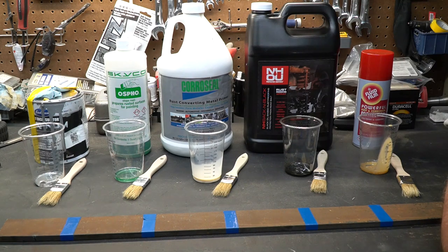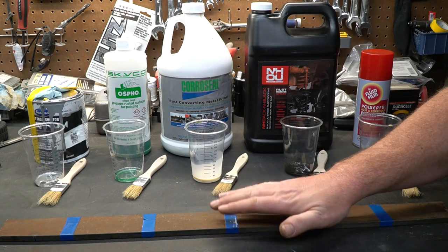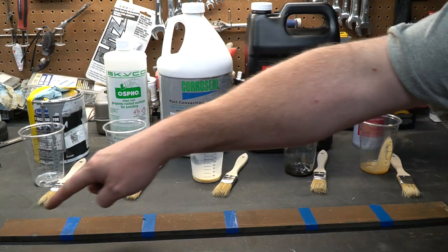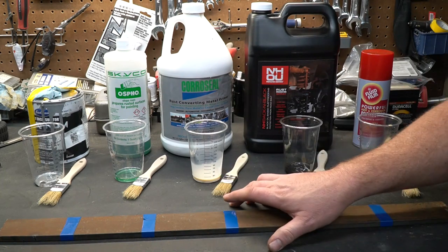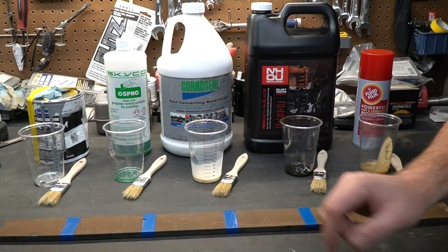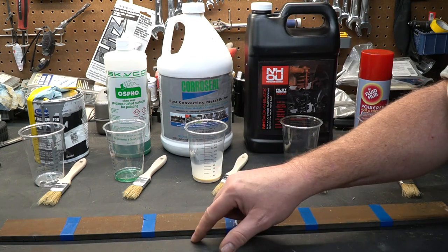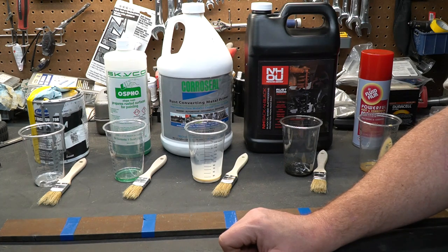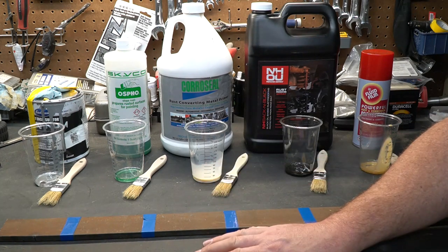Our little experiment here is going to be pretty straightforward. We have this two-inch rusted piece of stock bar prepped — I took a wire hand brush to it and cleaned off all the loose rust. I have it sectioned off into six different spots; the first spot we're going to leave as is — that is our control group. The rest of the spots we're going to apply our products to. The Ospho and Corroseal both require a top coat in my experience, so after they cure over 24 hours we're going to top coat exactly half of each with a simple can of Rust-Oleum paint. We're going to revisit this after winter, laying it in the yard so anything not protected will surely rust out even more.